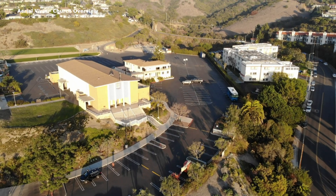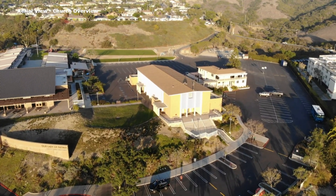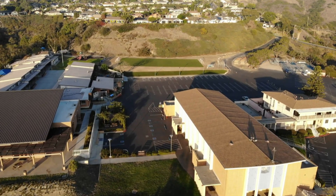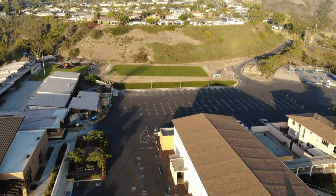We're going to be replacing these 400 watts with 150 watt Next Gen 3 lights. We're going to be putting in motion sensors and doing some programming to adjust the lighting, making sure that we're not wasting power. You're going to see the big difference just from the start — from 400 watts down to 150.